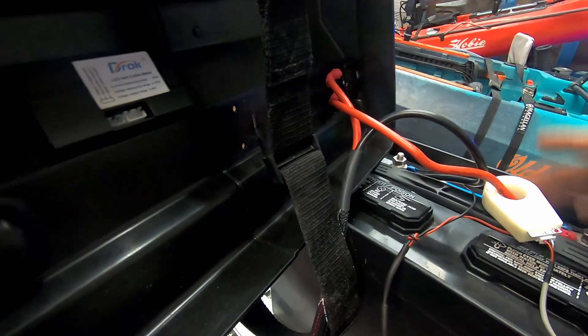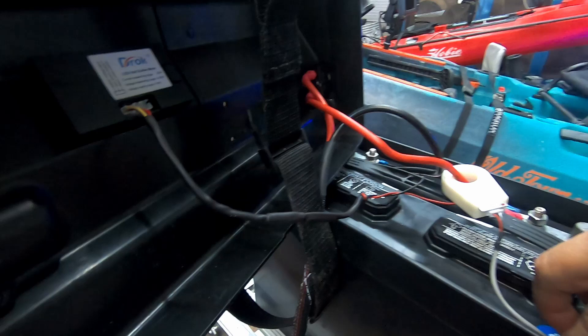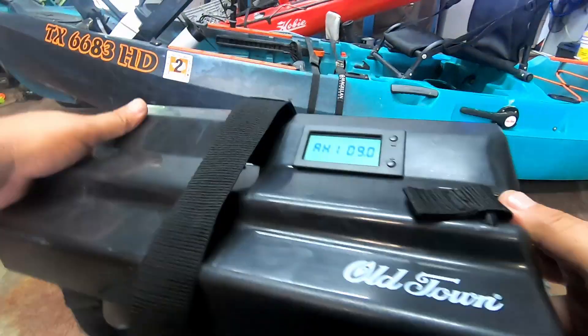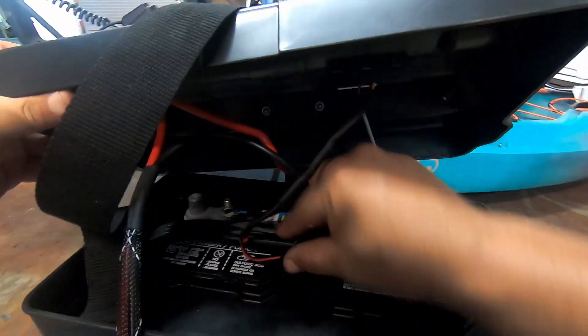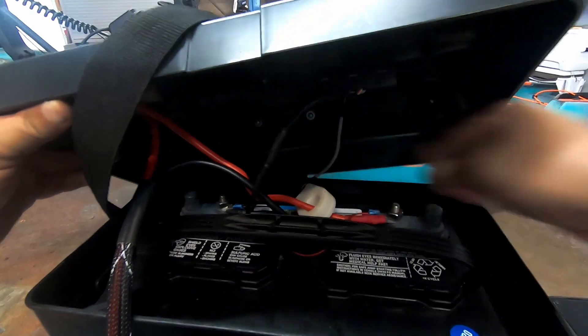With the 14 millimeter wrench, just secure the terminals. Now that we have the positive hooked up and the ground hooked up, we can plug our meter in — positive to positive, negative to negative — and slap it all in there. Then hook up our transformer so that it can start reading. Now we can just close this all up. You'll notice as soon as it powers up it's flashing, and I'll get to that in a second. Let's just make sure everything is all secured nicely.